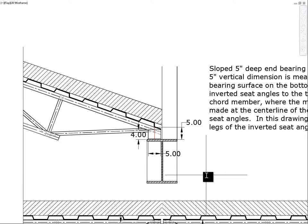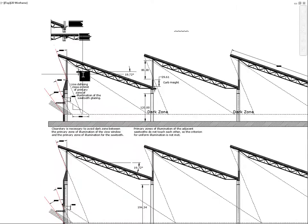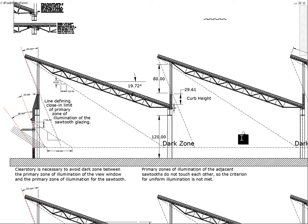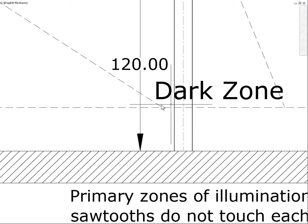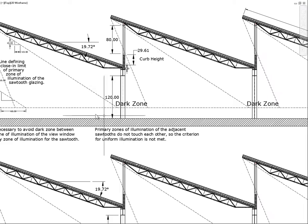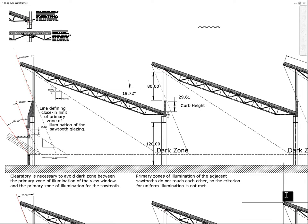I'm emphasizing this so the drawing will be clear about the rules when making sloped rafters. In the AutoCAD drawing, the south zone and the next-to-south zone are shown, with the column centerline 30 feet from the adjacent column centerline. The short-dash-long-dash convention represents the centerlines of columns or any building structure element. Three column centerlines are shown here.